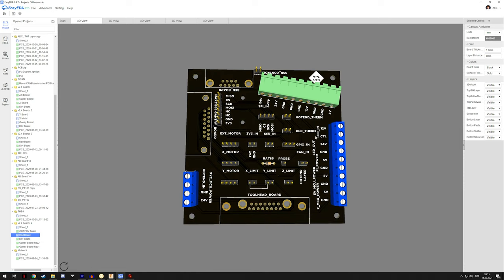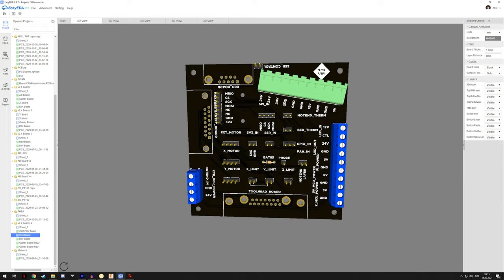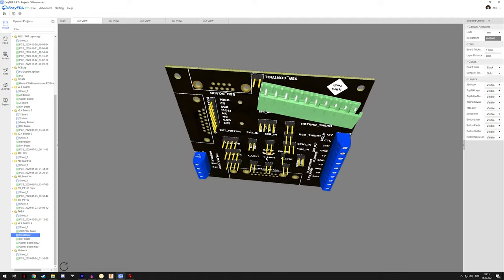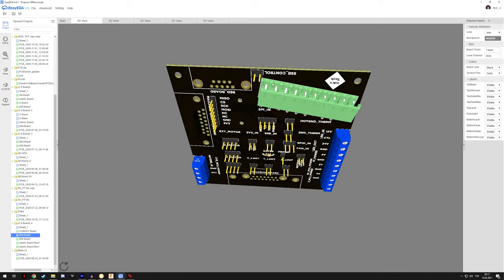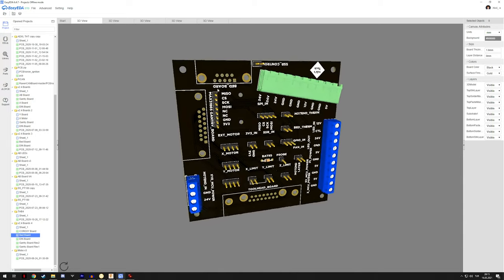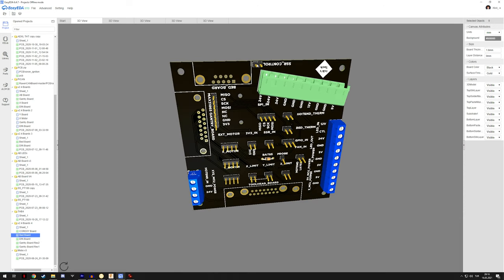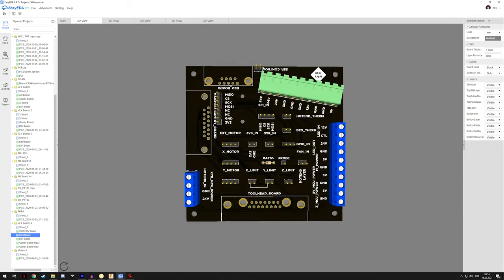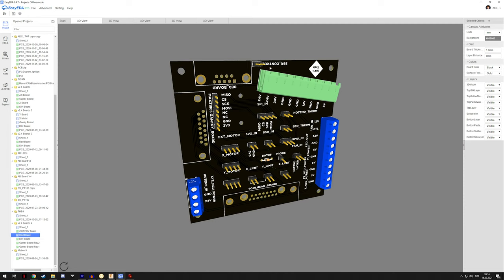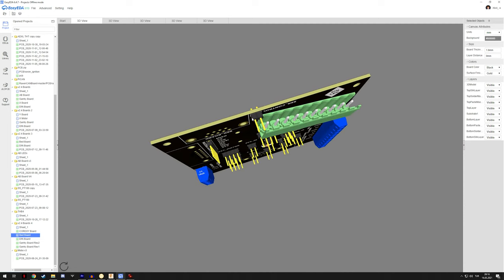The new board also now serves as an electrical distribution block for DC only. From the bottom electronics chamber we'll get power to this area: three wires for 24 volts, five for ground total, one for 12 volts, and one for 5 volts. I'm going to use terminals here — not this connector specifically, but same pin spacing. The SSR will connect here, and I'll probably use KK or JST XH connectors for most of the pin headers, as they're the most compact.